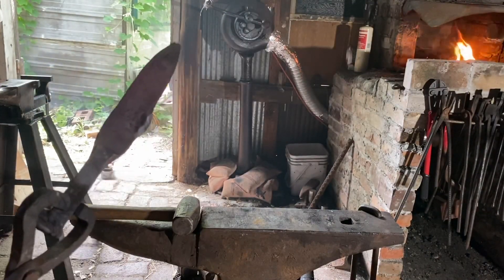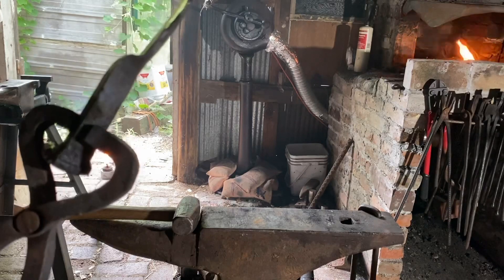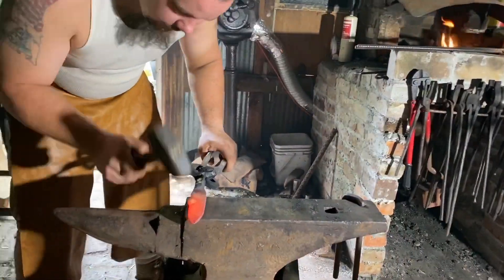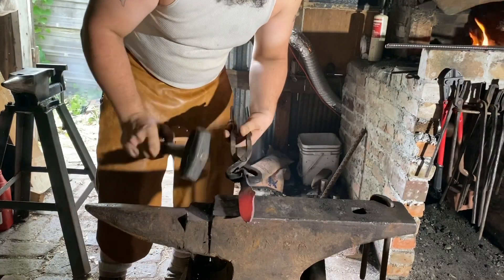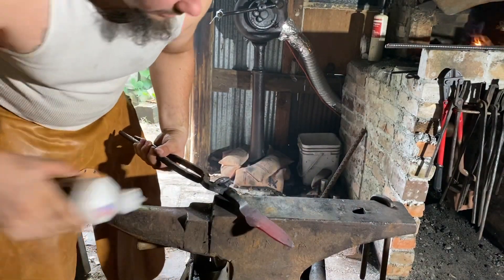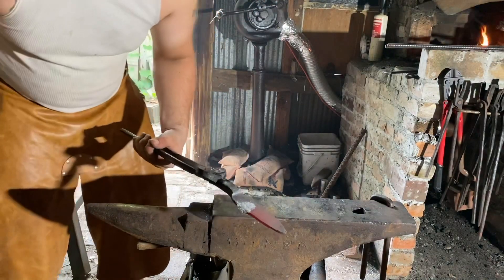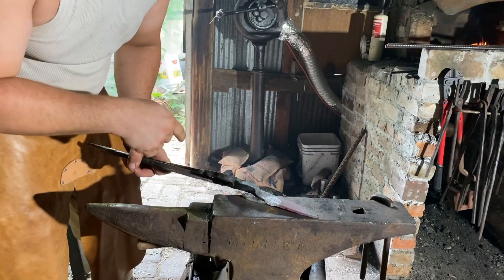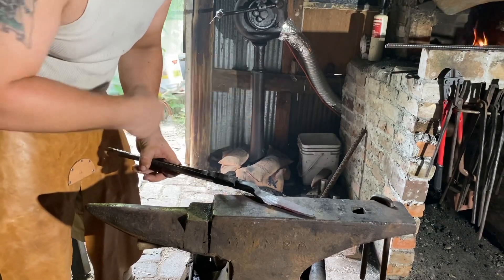See how we're getting that little pooch? We're not quite a knife edge on that pooch so we'll give it one more heat. We'll grab our notch a bit, give it a brush and some flux — much more flux than needed. And we'll set this aside and return to cutting the head off the pan shank so I can hold it with another pair of tongs, and we will weld these.